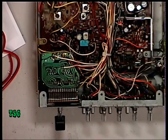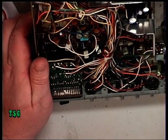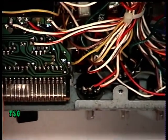As a footnote, one of the subscribers has acquired a York 863, which of course uses the same chassis, and it's also had some silly modifications — one feature lost is the dimmer control. I'll show you how it's wired on this radio so you can copy it; there are actually only two wires and it's quite straightforward. The dimmer control is the one at the end nearest the display. You have the white wire, which in this case has a ready orange tracer, which goes to the right-hand tag; the red wire goes to the center tag and is linked across to the left-hand tag.